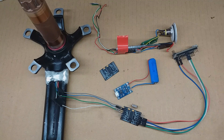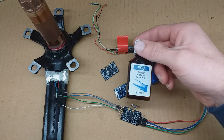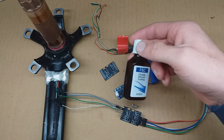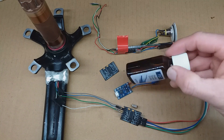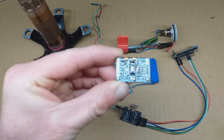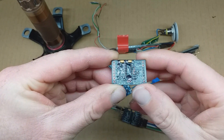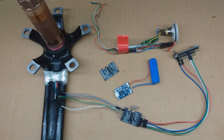I've been experimenting with a conformal coating — this type here — which so far seems quite good. It's a flexible coating; you put it on reasonably thick. Here's an example where I did a bit of a test. It seems okay, so I'm going to try that out as protection.